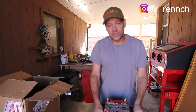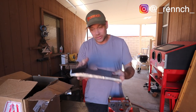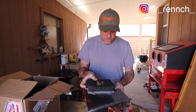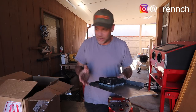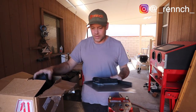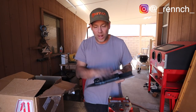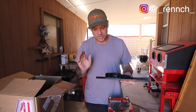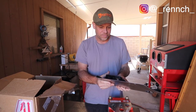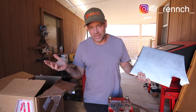I now have to do basically the exact same process on the other side, but for my Haltech ECU. So I need to cardboard a design, set this Haltech stuff up where I want it, create a template out of paper, make it out of metal, bend it all up, weld on the captive nuts, and then we'll be good to go on this side. So that's what I'm gonna do right now. Just assume that it's the exact same process.